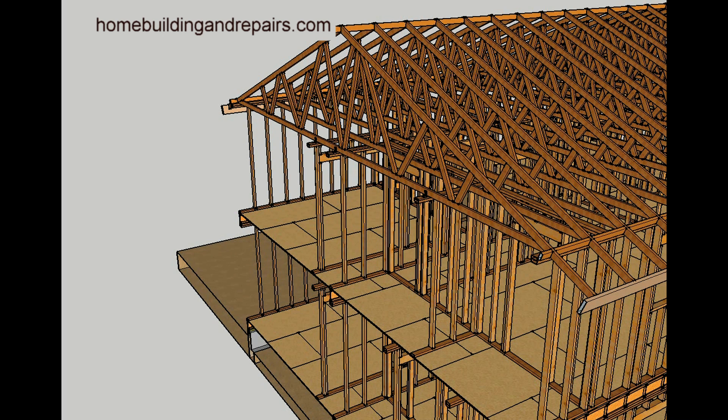This can create problems for your roof system. As it contracts and expands over the seasons — say in the winter in a high-moisture area — the moisture absorbs into the roof truss and expands, putting pressure on the drywall ceiling and framing components. Then in the summertime the wood dries out, and this movement from expanding and contracting can actually damage the drywall ceiling.